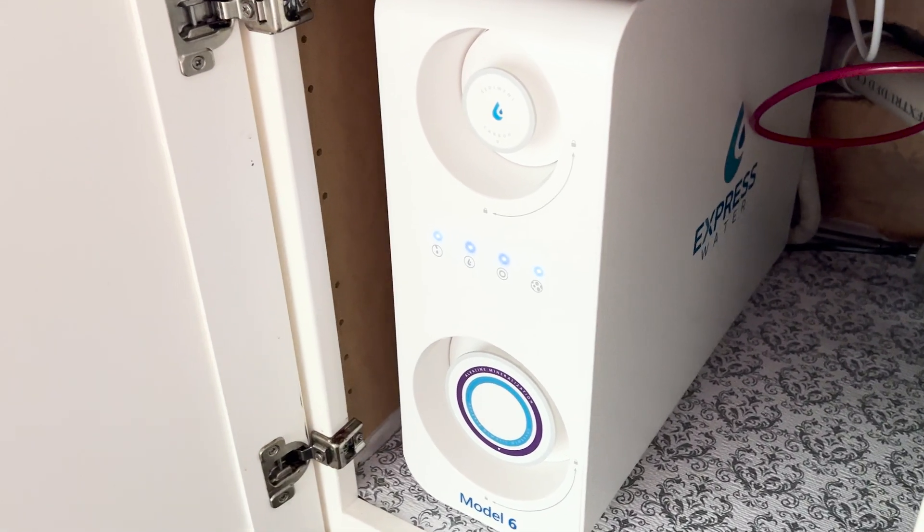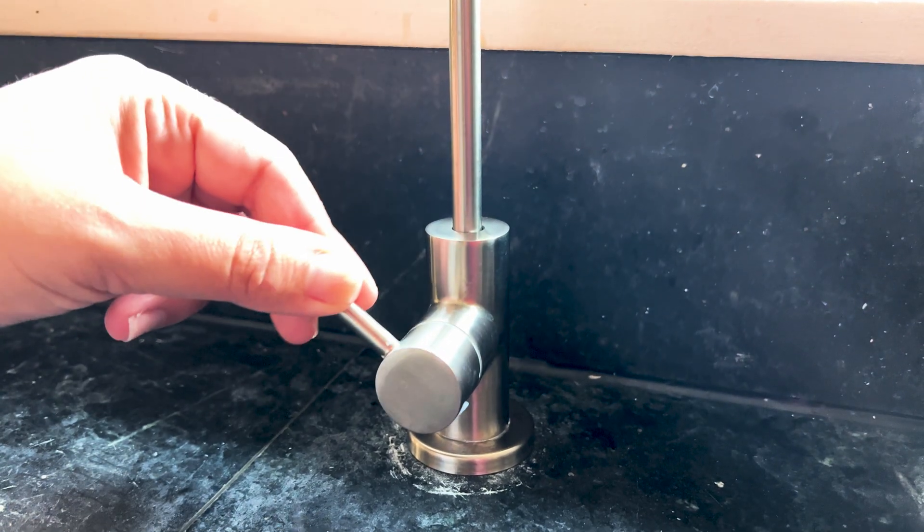So your water tastes great and it makes it even healthier. I moved into a new house and this house already had an RO system under the sink, but it was the kind with a tank. With a family of five, if everybody tries to fill up their glasses of water during dinner or fill up their water bottles one after the other, the tank would run out of water really quick. You'd start out with about a half a gallon per minute and then after the second or third cup, it'd be like dribbling. With a tankless RO, you don't have to worry about having a tank prefilled with treated water. It's going to treat the water on demand, flow through the filtration system out of the faucet and straight into your glass.